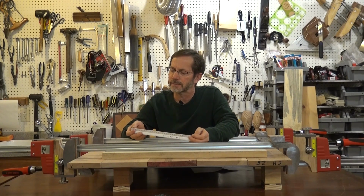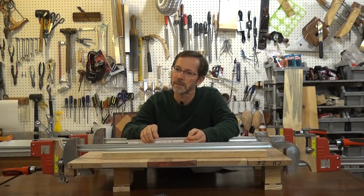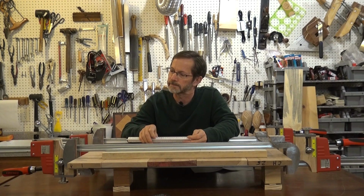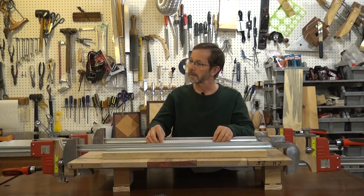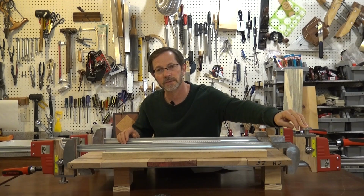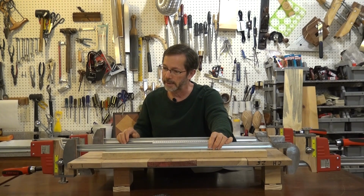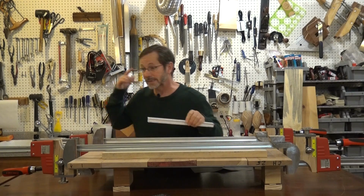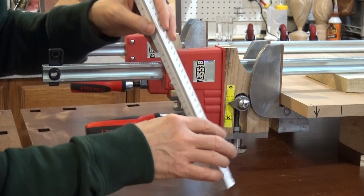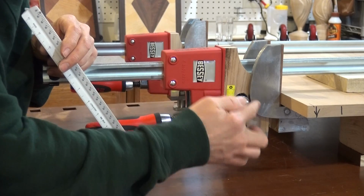So I looked at that and my initial thought was that the ramp looks awfully steep compared to what we've had before, and I don't know how much we're really going to get the mechanical advantage and exert the pressure down on the face of the panel like we did with the original design. So I brought these into my shop and I said, okay, what if I left the adjustment on this existing design set at 3/4 of an inch where it was originally, and I put a thicker panel in? My reasoning, and I'll show you over on this side here, is that I wanted to change the effective angle that the roller meets the end of the clamp.